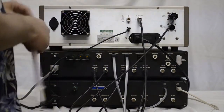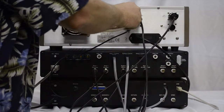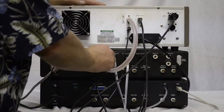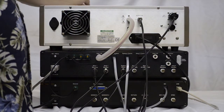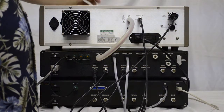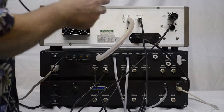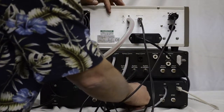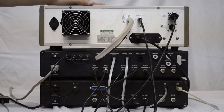With the low voltage input, the amplifier scales and puts a high voltage output out of its HV out port — up to 10,000 volts in this case. This output is taken into the HVI amp one HV port, passed through the HVI, and out of the HV drive port at the front panel of the HVI. This stimulates the sample, and the opposite electrode generates a charge that is collected into the HV return port at the front panel of the HVI, taken through the HVI out the system return port at the rear panel, and into the tester return port. This completes the connections necessary to make your measurement — it remains only to power on your equipment, generate a waveform in software, and make your measurement.